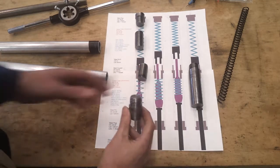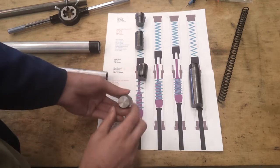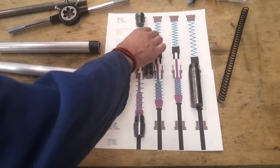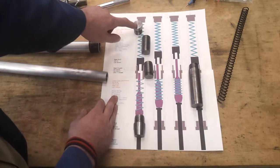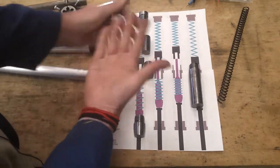Here they are - that's the end piece which I've taped off the front and I'm going to drill through so I can get the plunger in. That's the coupler in the middle which now needs boring out. I've done a second coupler so I can extend the tube outwards, and then that's the end piece which I'll also drill and tap so I can put a tee piece handlebar on it.